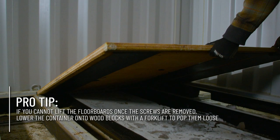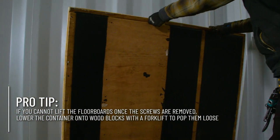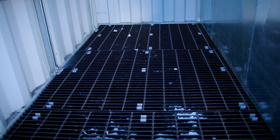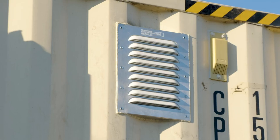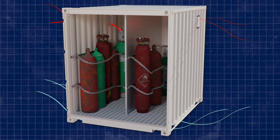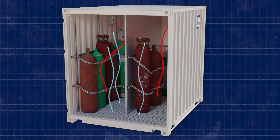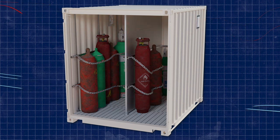This is going to be used as a cylinder storage container. That's the reason why they don't want any wood or any flammables in this. The bar grating in here is going to act as our lower vent, and we're going to install higher vents up on both sides, so the air will come from underneath and above if there are any gases in here — whether they're lighter or heavier than air, we have options of either exhausting out the top or the gases will flow out underneath this container.